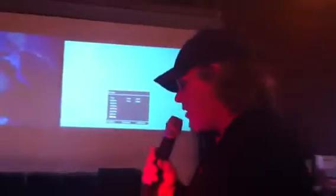This allows you to have the cameras either go through the receiver for a couple of reasons with your setup, or you can go direct to the switcher. We even allow you to have different cameras going through different projectors at the same time. So it gives you a lot of flexibility, and that part is great. If you want to monitor those cameras, you will run the video cables at the same time and send the video to the video inputs while you're doing the HDMI inputs, and that allows you to see the cameras in the monitor at the same time that you have the HDMI going through the switcher that way.